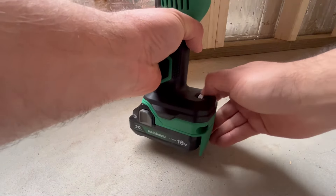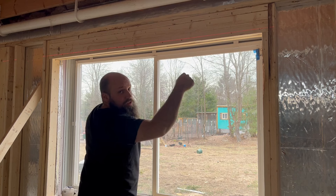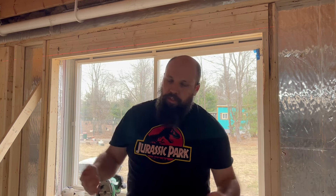Let's see how loud it is on the higher speed setting — that's still really quiet. It's got a light on the front. I want to test it out here in just a little bit. This is actually right about where I wanted my header to come out. I've got my laser level up there. What I'm planning on doing is attaching a two-by-four across the opening so I can set my circular saw on that and run it across. If any of you are looking for a laser level, they can be fairly expensive at Menards, Home Depot, or Lowe's. I was able to get one that does 360 degrees from Harbor Freight for $99.